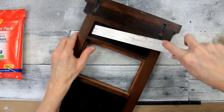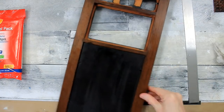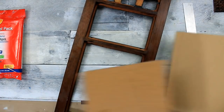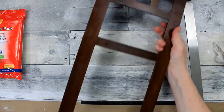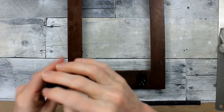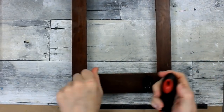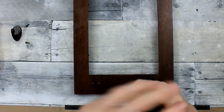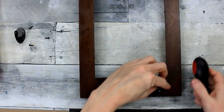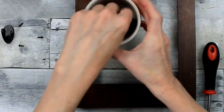Giving them a fresh start — so a bath is the first part. Then I'm going to use my metal ruler from Dollar Tree to pop out this little wicker-like insert, clean that up, take the back off and the cork board off. I'm going to take my regular little screwdriver and remove this hardware. This makes it so much easier when you're painting an item — just take the hardware off. Otherwise you're going to have to tape all around it to keep from getting paint on it, and it slows your process down. This makes it a lot quicker. Those are tiny screws, so be sure you put everything in a bag or a bowl.